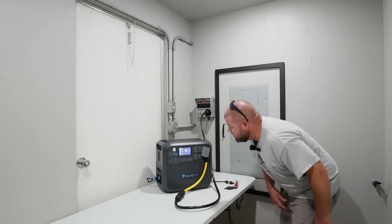All we have to do now is turn that on and make sure we're getting input. It's really late in the day — you can see the sun's all over here and it's not even really on the panels well. But these panels have been working so well. I mean, look where the sun is — I guarantee we're still getting some solar in on those. We're pulling in 450 watts, bouncing around a little, and this is already later in the afternoon. The sun's off to the side and I don't even have those solar panels aimed correctly. We're about to double them up, which would put us at around 900 to a thousand watts this late in the afternoon and probably close to 2500 watts during the middle of the day.